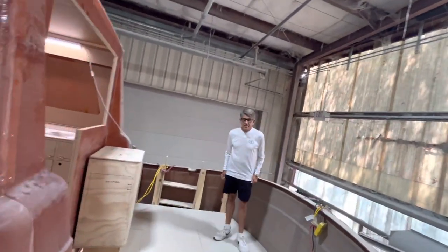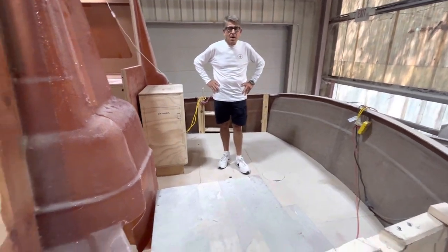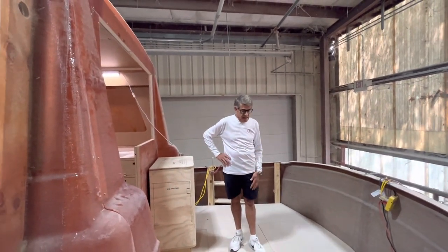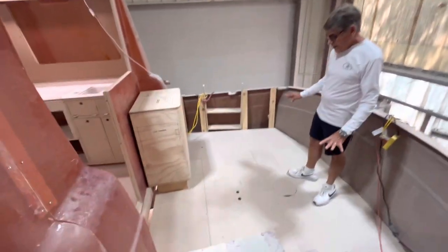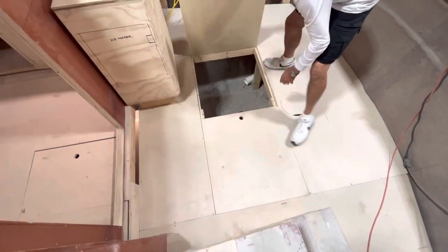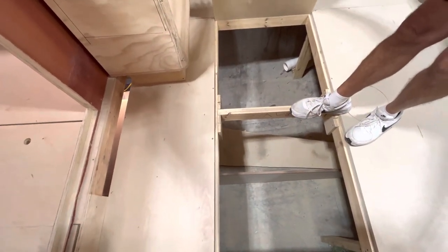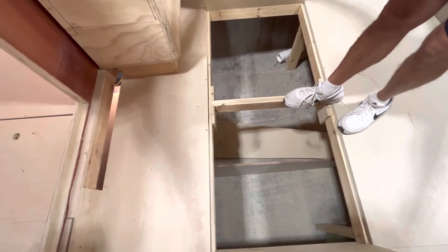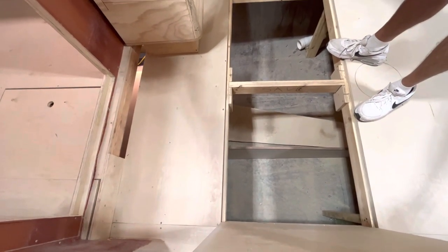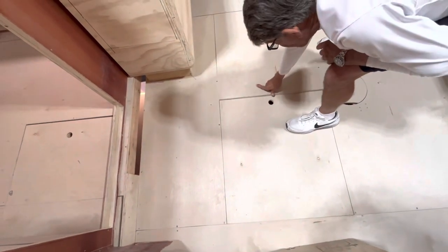Alright, so obviously I'm in the cockpit — this is the cockpit of the SP Cruiser Mark II. The last SP Cruiser that Bob Johnson built was extended by about three feet, so we didn't need to extend the cockpit because he had already done that. We did change all the access to the lazarette for storage — there was a bunch of smaller hatches in the past and we've made two large hatches that will be held up with pneumatic pistons, with a removable centerpiece that will allow us to put larger items in there, even as much as a folding inflatable dinghy. We will do teak grating all along the hull bottom so nothing would be sitting on the hull itself or in any dampness.